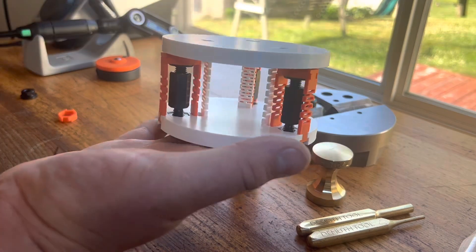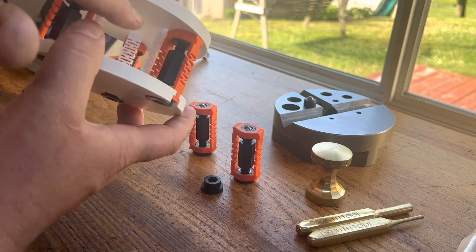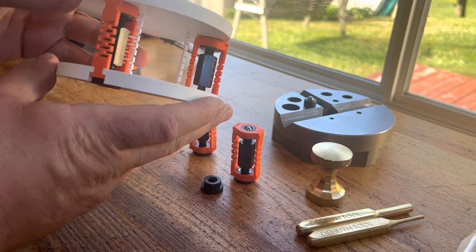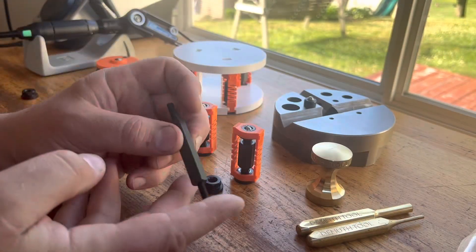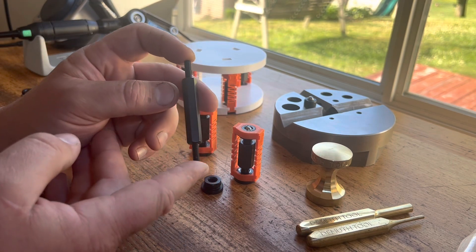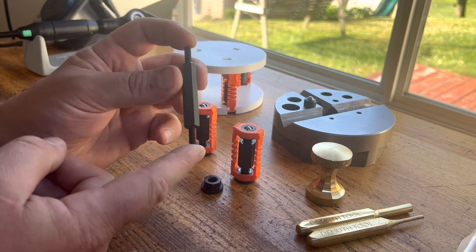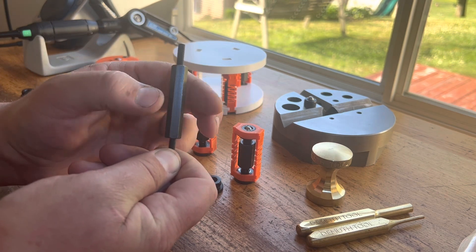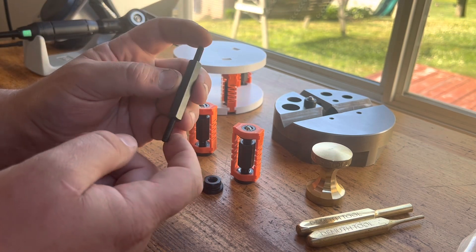The concept can be expanded into things like kinematic bases. I just have the top located with a Maxwell mount, with more of these little printed springs holding it all together. The concept can also be applied to smaller screws — this is an M5 and a 10-32. That yields a differential pitch of two-tenths, 50 millionths of an inch, or about a micron per flat. Each flat increment would yield a micron of growth, which I think is really quite profound for off-the-shelf hardware.